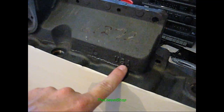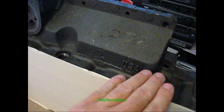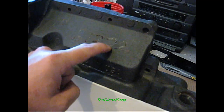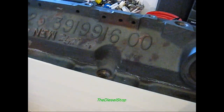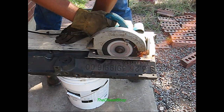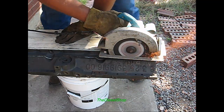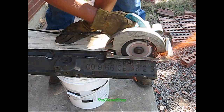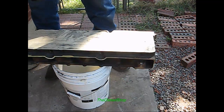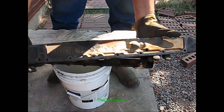I'm going to set everything up and take my saw, leaving about a quarter inch sticking out off this head on the intake plenum. Then the machine shop will come back in and resurface everything down nice and smooth. They're also going to drill and tap holes into this head after the plenum is gone for the new flange to bolt up. Here's part of the intake plenum after the first cut.